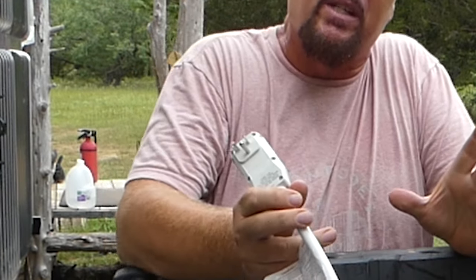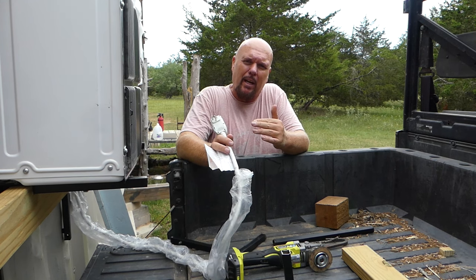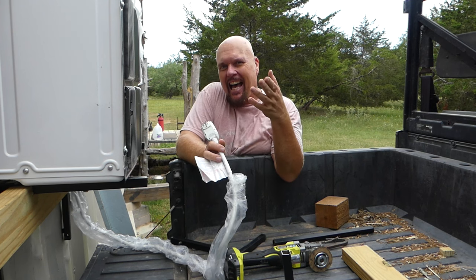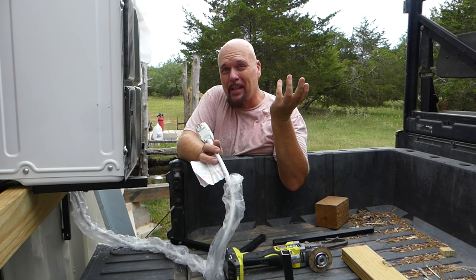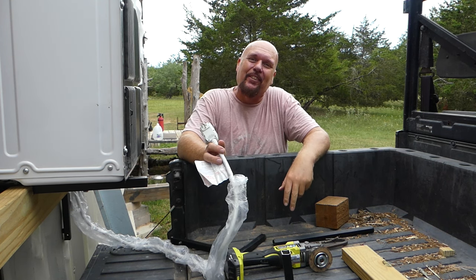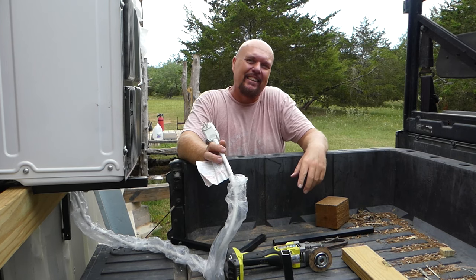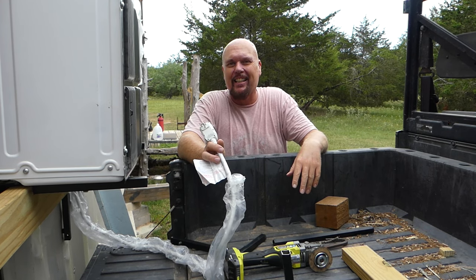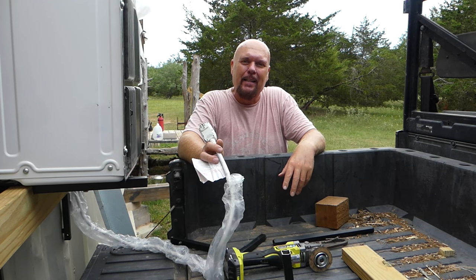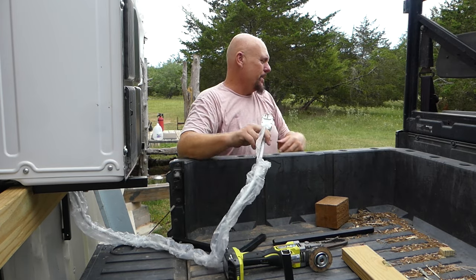Now I bought this as 240, 20 amps, so it'd be more efficient on my generators and with solar when I get done with the solar. Again, I'm just trying to size these AC units to put up with the million degrees that's heading this way. So far, all of the AC units that were sized for this place just couldn't keep up. They were one-third what they needed to be. This is a 540, about 550 square foot, 12,000 BTU, 240 volt. So let me finish this up.